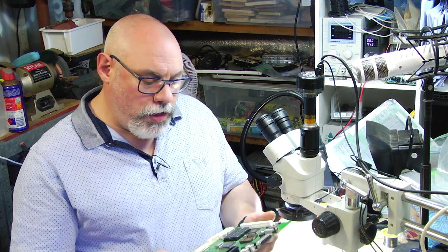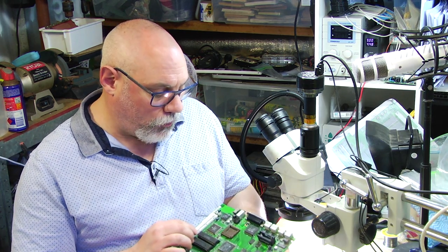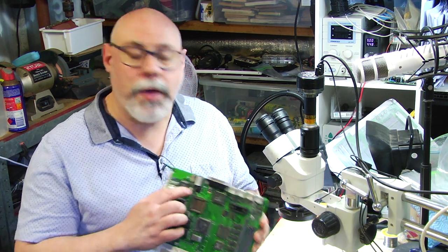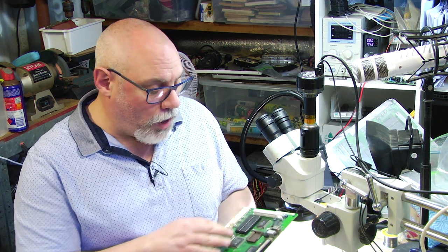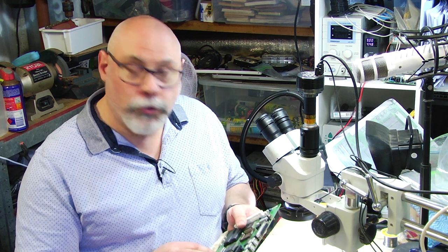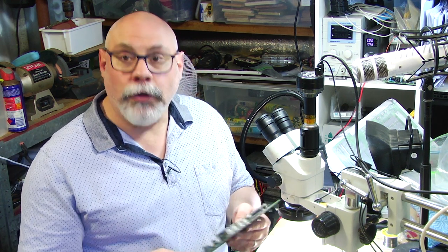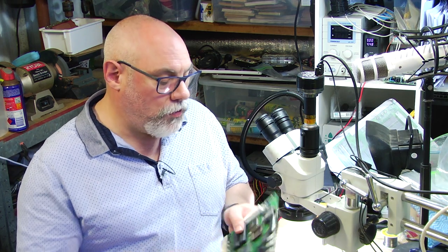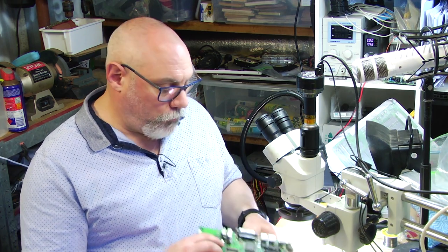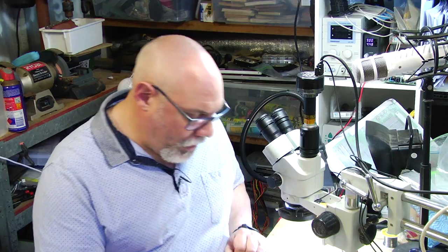Okay, so the Macintosh Color Classic is one of the many computers that suffers from leaky electrolytic capacitors, which I do go over in my other videos. If you want to find out more about it, you can do a Google search for capacitor plague. But the short story is that there are lots of computers from a particular vintage that have these little surface mount electrolytic capacitors, and after a few years, they leak.